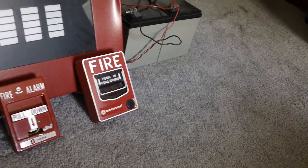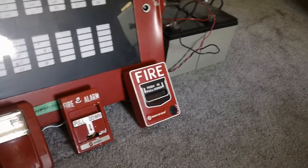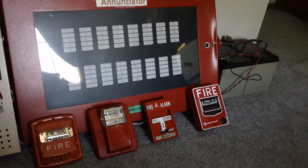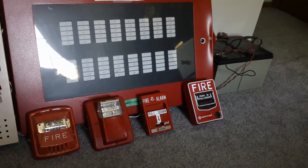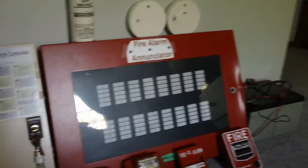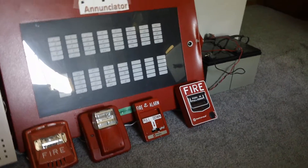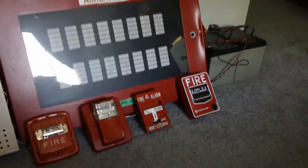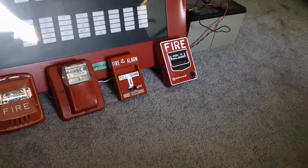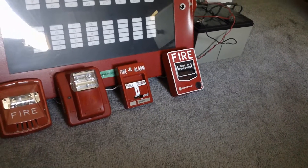The reason why I did this is because yesterday I came in here and was about to make the birthday test video for you guys. I tested the pull station and everything was going well until I came to zone 2 and I was ready to test the smoke detector. I sprayed some dry smoke in the detector and it didn't go off. So I sprayed some more — it didn't go off. After that I decided to take off the head, inspected the wiring, and decided to rewire the base, but that did no good.